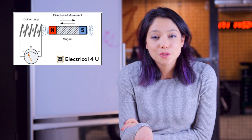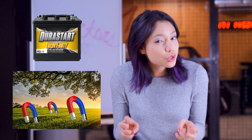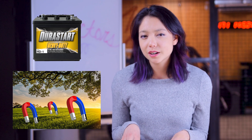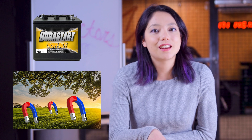Because of Faraday's laws of induction, when an electric current is passed through this coil of wire, a magnetic field is created. This magnetic field can actually store the electric current for a short period of time even if the supply is cut off. Just like capacitors can store charge, inductors can store a magnetic field which can provide current.